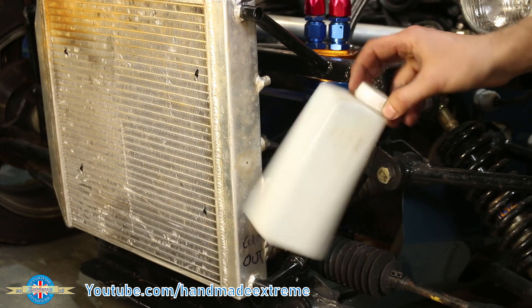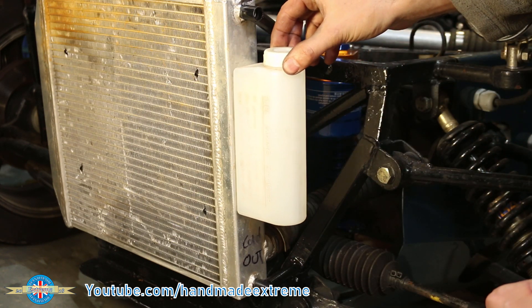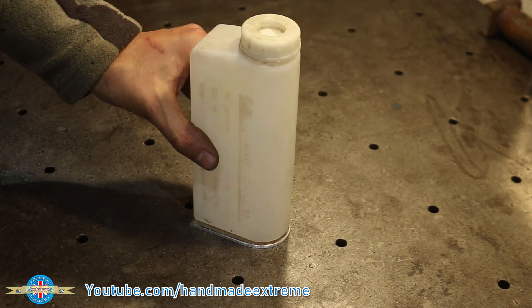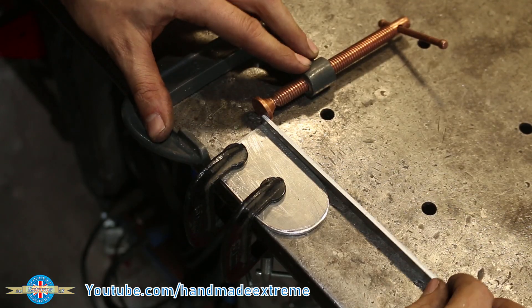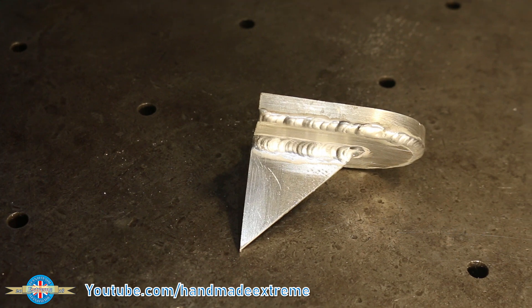I need an overflow tank for the radiator — a little bracket here for it to sit on and a strap that goes around it and connects to that threaded boss should hold it fairly securely. The bracket is a simple construction: just a little base plate that goes underneath the bottle with a little lip all the way around the outside to stop the bottle sliding off, and a small gusset underneath to stop the bracket from bending. I made a temporary bending jig out of a few G-clamps for pulling the lip around the outside of the base plate. If you look closely at the arc it looks like it's flickering on and off — that's because this is aluminium and you have to weld it with AC rather than DC like you would normally use for steel. Here's the finished bracket, which just gets welded straight onto the side of the radiator.